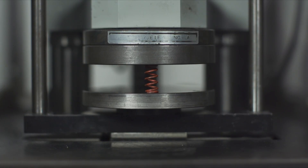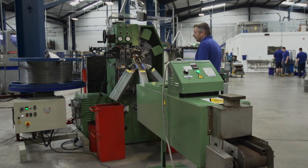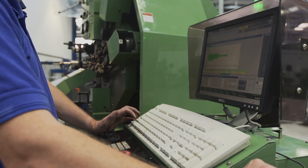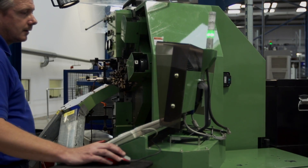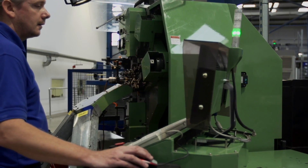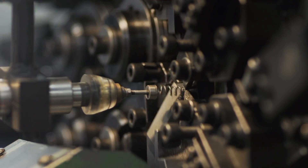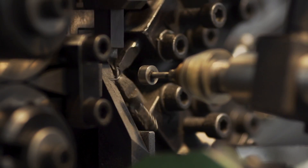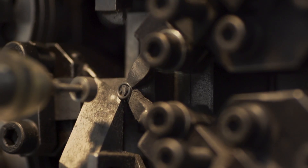Prototype springs were submitted for evaluation before being approved for bulk production. The first process in the manufacture of the upgraded spring is coil winding. William Hughes engineering director Emma Bergen explains: normally for our customers the most important thing is load at a specific length. Here we're using the latest CNC technology not only to provide very consistent coiling accuracy, but also to measure the free length of every single spring as it comes off the machine. The machine then uses statistical process control to sort every single part, so that we know that what is coming off the machine is good at this point, to provide the tight tolerances that our customers require.